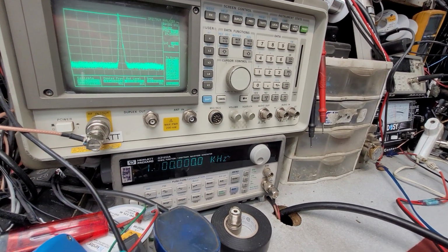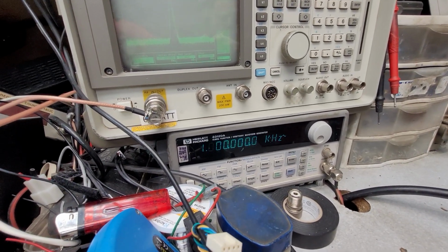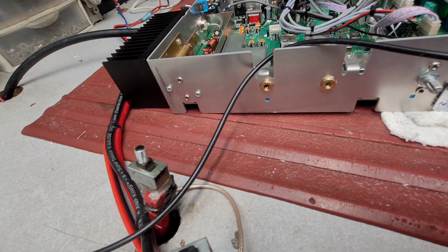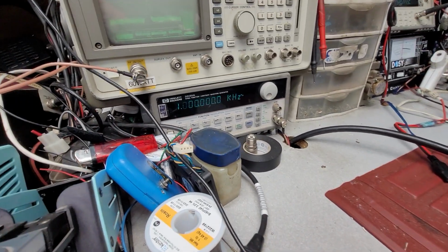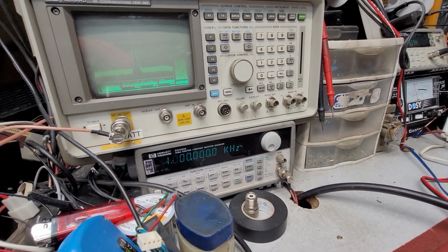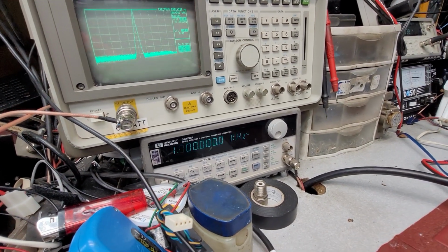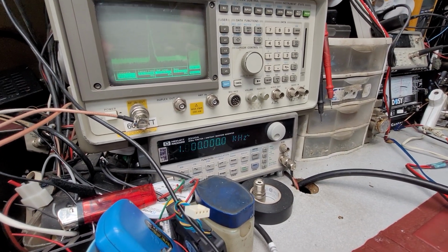Any kind of way that you want to run it, however you want to set it up. I could boost the treble back up in there, bump the gain back up just a touch right there. So it really has the versatility to run it however you want, really. I would probably say, bottom position on the mic, D104 set at 5 right here, mic gain set at about 1, and then the treble would be preference.